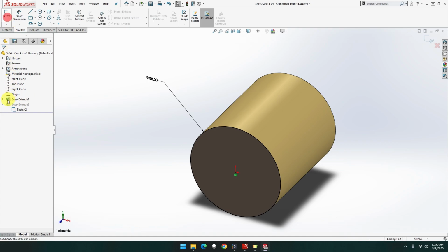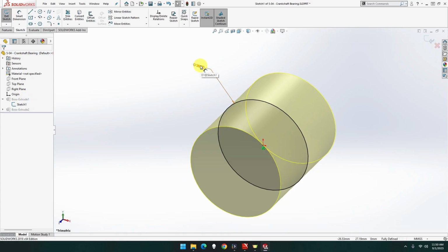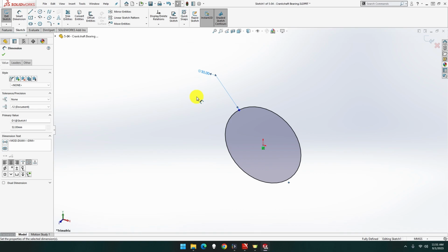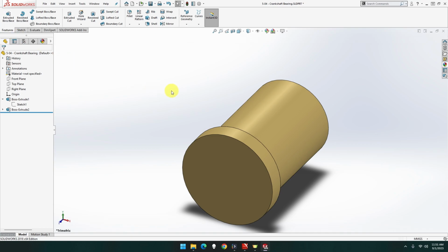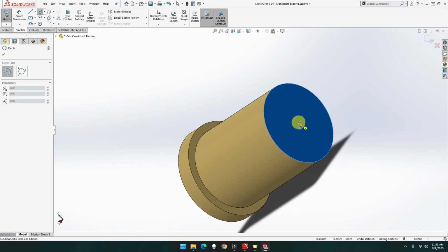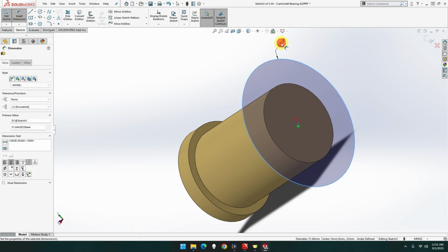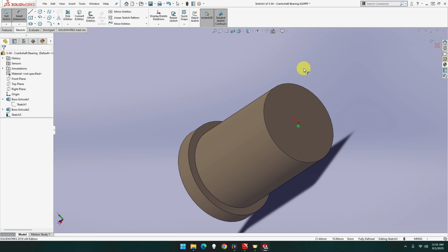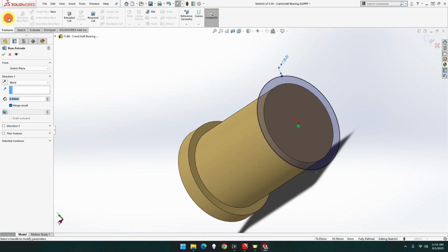Exit out that one. This one here should be 32. Done. Exit. There we go. That's better. This one here will be sketch, circle, dimension, don't forget that this time. C2, nope, sorry. C8. Oop, what happened? C8, thank you. Extrude's going to be 6.5 as well.